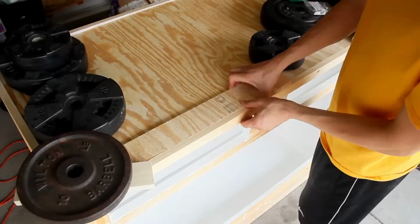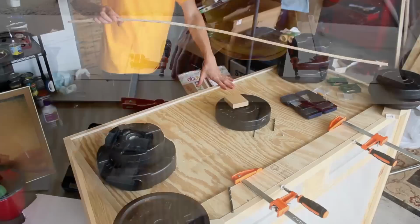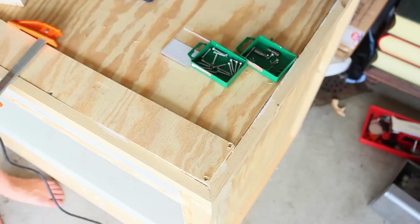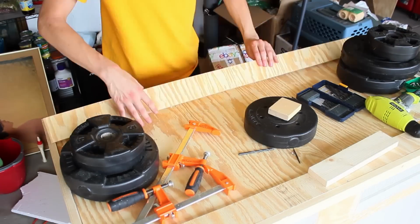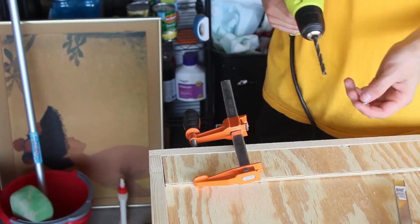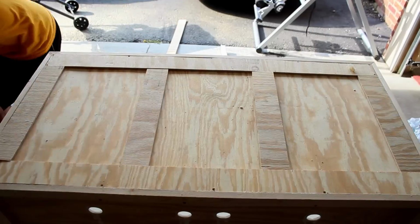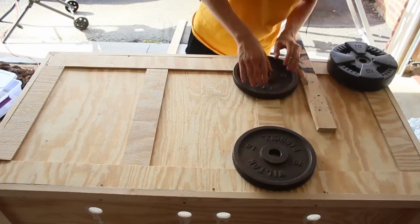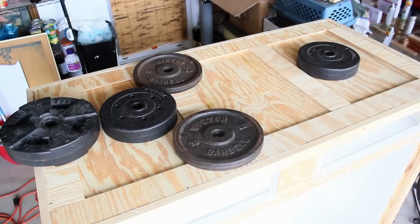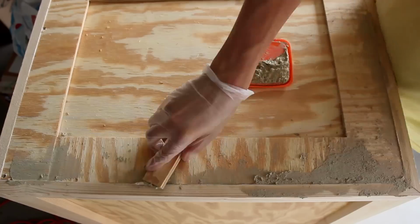Then I cut 6 strips of plywood and attached them to the top using wood glue and screws. The placement of these boards is specific to what I want to stack on top of the tank, so I won't explain much about them just yet. I finalized this section by adding some wood filler to conceal the screws and any gaps.